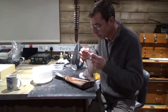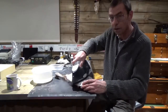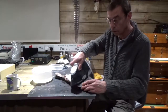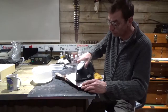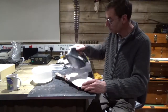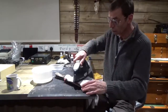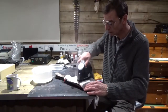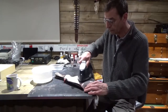There's just one more little mark there. Like I said, I really did give this a good hammer to put some really good marks on, just so the camera picked them up — because cameras don't pick everything up, so I tried to put plenty of dints on so you could see them beforehand. Just give that a good steaming. Move the cloth around — as the steam finishes, that means the cloth's nearly dry. It doesn't take long to dry afterwards because as you're steaming it you're drying it anyway, so just stand it somewhere warm for half an hour or an hour or so.